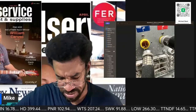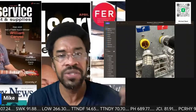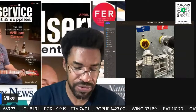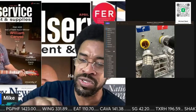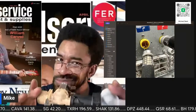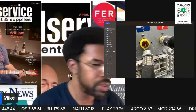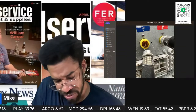You can even see over here, even the cold is completely rusted. Look at how bad that is. So that's what took out the valves. Unlike Dexter and some of the other lines, these valves are not serviceable. Fun, right? These valves are not serviceable. Yeah, you could take them apart. You can take these suckers apart, but there's nothing you can do with them once you do that.